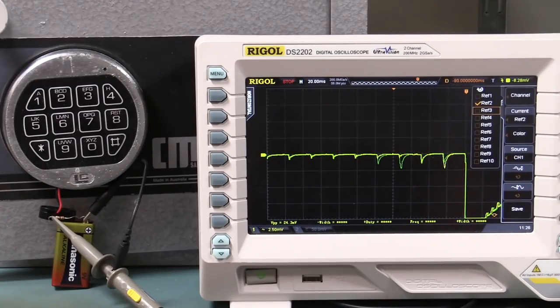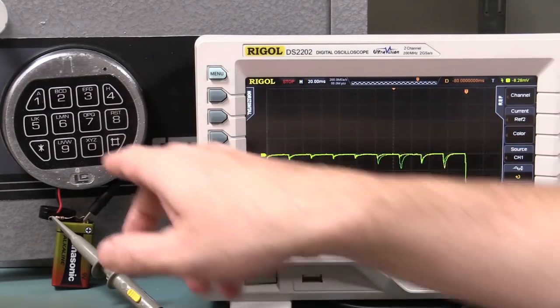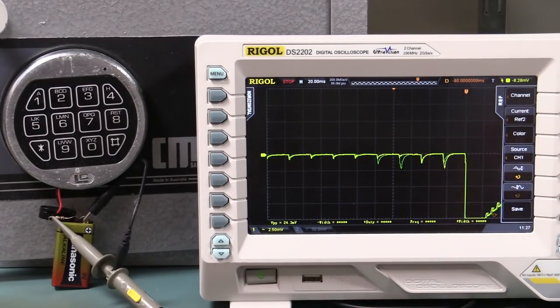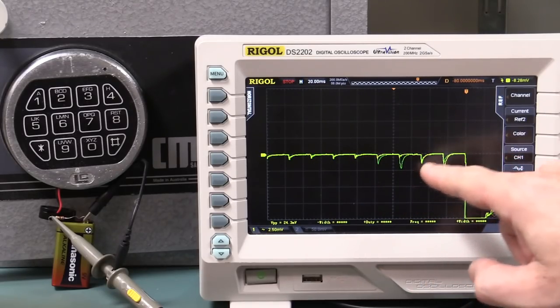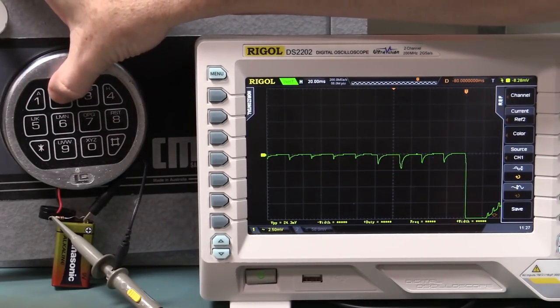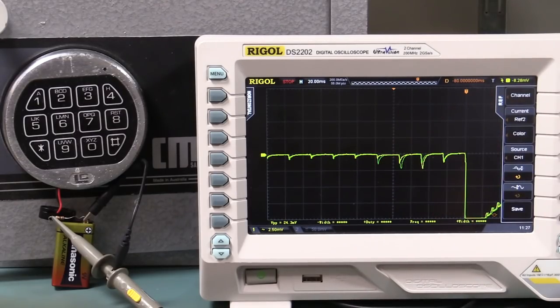Now, I just wanted to re-verify that the correct digit sequence was repeatable. You know how I captured the green waveform before with 1, 2? Well, it doesn't seem completely repeatable now. It seems to be like one of two types. You can see the yellow waveform I just captured. Now, I'll do it again, okay? So here we go. I'll do 1, single shot capture, 2, and occasionally it'll match the green one, but often it doesn't.